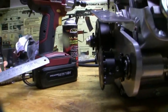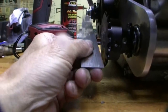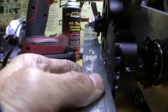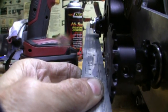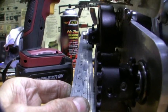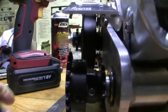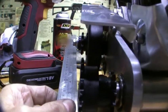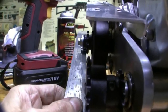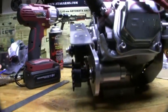This is the back view of the engine. So you get a nice straight edge here along this 20-tooth sprocket, which makes it real easy. When you hold that nice and flat against there, it's perfect — it just barely scratches it. It's not too tight, it's not making no resistance, but you want some resistance. You can hear it — and that's about all the resistance you want. This was machined on a metal lathe so it's flat, and that's why I'm spinning it, just to show you that it doesn't really matter.